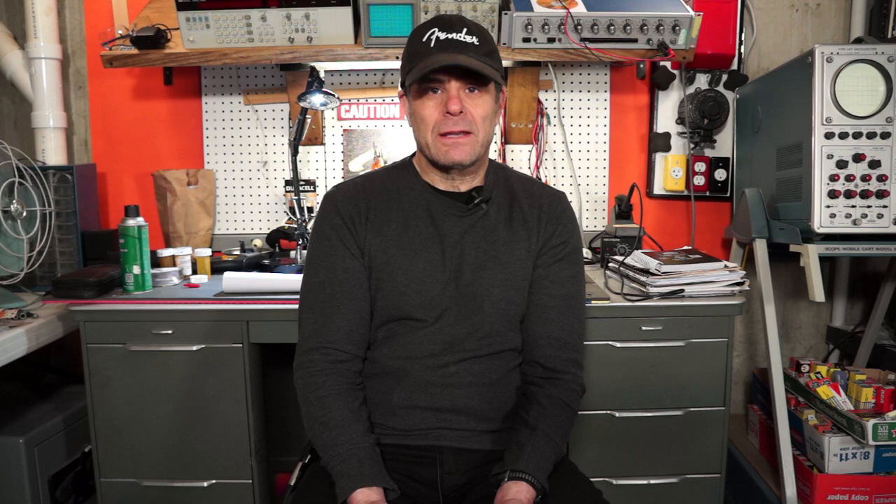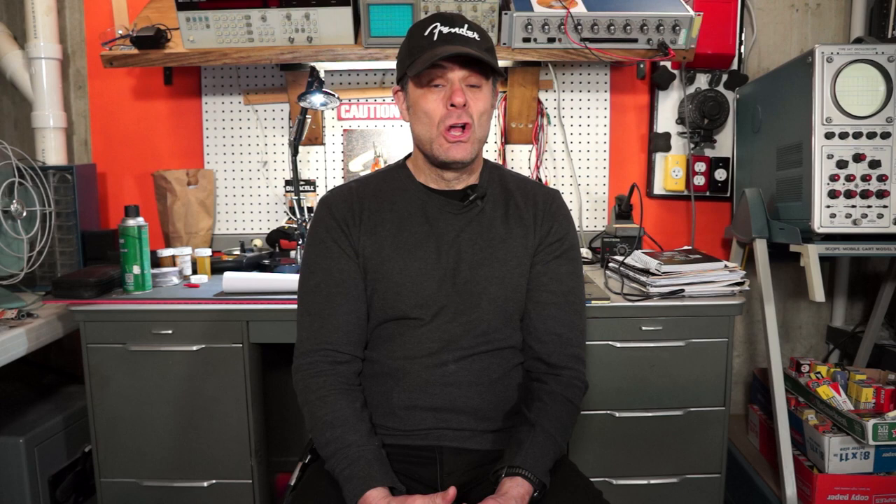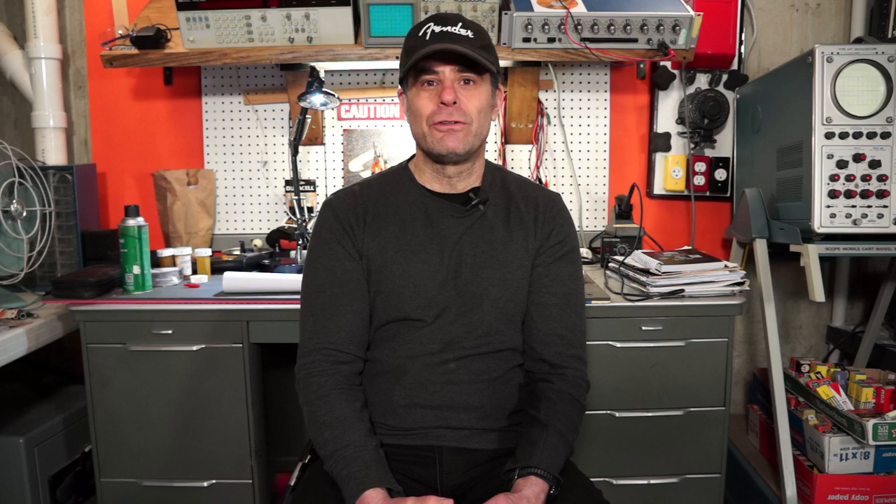And here it is — I'm showing you that light panel in action right now. That light panel was made from one of these LED strips plus some scrap aluminum, some scrap wood, and some scrap wires from the lab. If you had to buy some of that scrap stuff, it would probably cost you another $10 or $15 — so $30 is not bad for a big light like this. Some people may have to buy their own power supply, which might be a little added extra expense. In my case, over the last 10 to 15 years, whenever I've had to get rid of some electronic device like a computer or speakers that needed a power supply, I kept the power supply. Now I have a big collection of those things, and some of them are coming in handy for these lights.